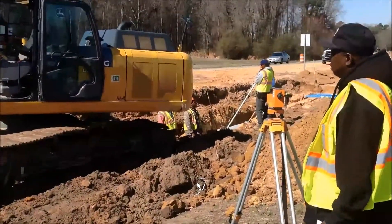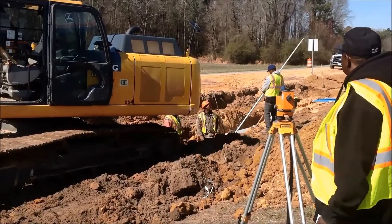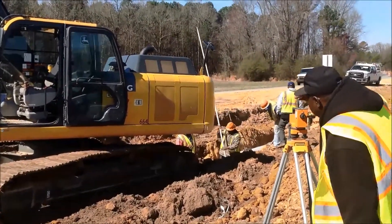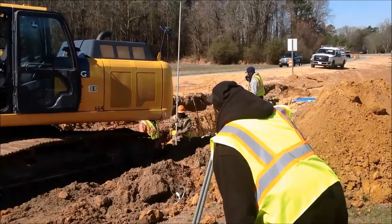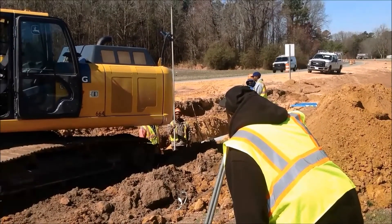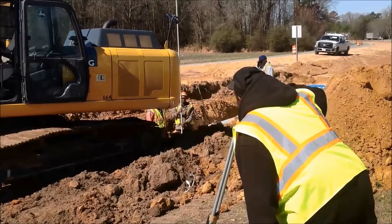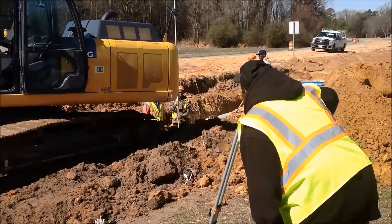Observe pipe sections after delivery to the site. Record any rejected section and the reason. Ensure that the concrete pipe has been stamped with the department's sealed approval, and mark any rejected pieces of pipe. If the prime contractor has subcontracted out this operation, you must have an approved subcontract agreement form from the resident engineer in your possession prior to allowing the subcontractor to perform the work.